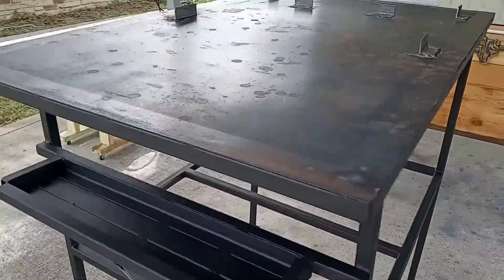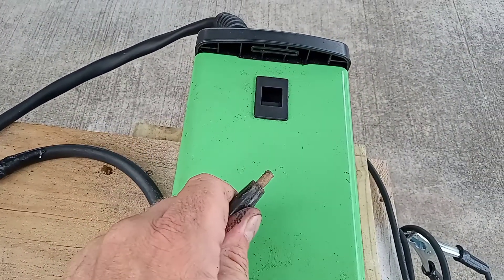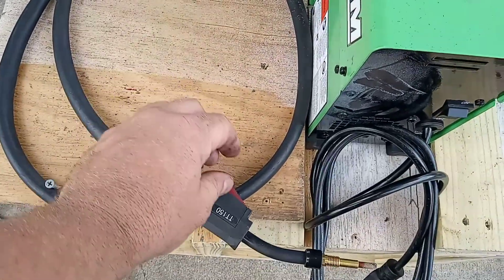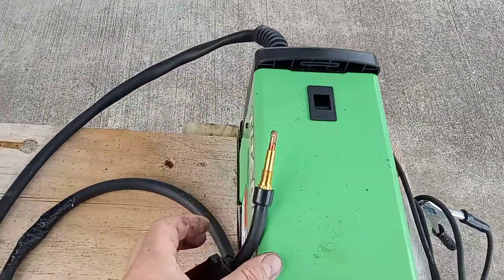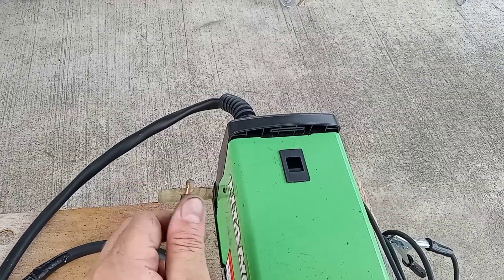Overall I'm very impressed with the machine. I've noticed after welding for quite some time — it's mainly tack welds putting stuff together — that this tip, just like any other tip on any welding machine, gets corroded or gets a bunch of spatter. You have to keep it clean. Once I changed the tip out, it created a much better arc and the beads were a lot easier to put down. That's about the only complaint I could find with this machine.